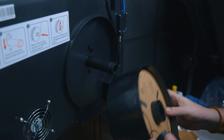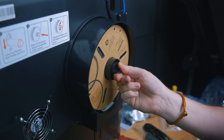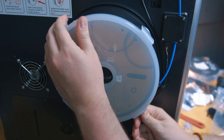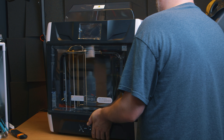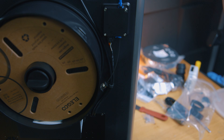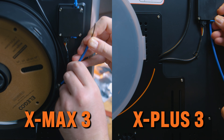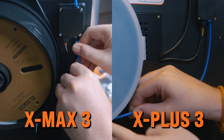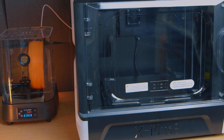When it comes to filament loading, this is the one bit where I actually have a gripe about the printer — and it's literally the only gripe I have. I'm going to keep complaining about this until brands stop doing it. With most enclosed Core XY printers lately, it's the hot trend to put the filament spool holder on the back of the printer. This holder is better than most because it's an enclosed box with a bag of desiccant to reduce humidity. But getting to it to change filament means you need constant access to the back of the printer, or you need to spin it round — which isn't easy because this is big and heavy. To make it even worse, the hole to feed the filament out of the box is tiny and in an awkward place, and the PTFE tube is so short and at such an awkward angle that pushing a reel through the filament runout sensor is an absolute pain. My advice: do not use this at all. Get a filament dryer box to stand by the side of the printer and get a longer PTFE tube to feed to the printer directly, just like I did with my X Plus 3.